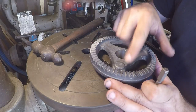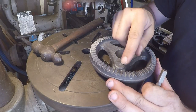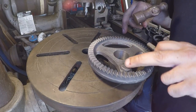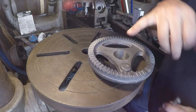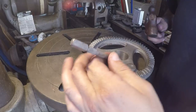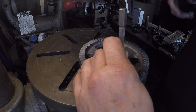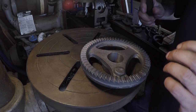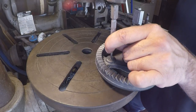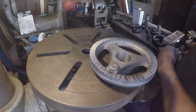Whenever I know I have to drill a hole in something I was working off an existing part, I left this hole with a little divot so I could find it again. Although it didn't come out very good — some metal got in there, so it's not a great hole to start in. I'm going to eyeball center and give it a little tap with the center punch. That should be enough to get the center drill started.